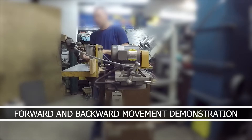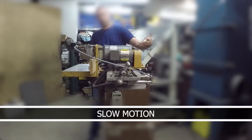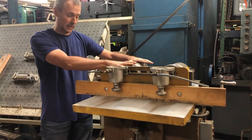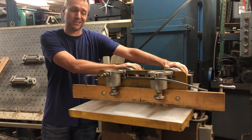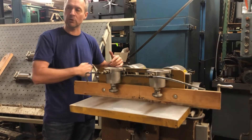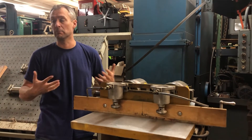One valve drives the whole motor and sled unit forward, and another controls the driving of the sled forward and backward. That's to keep it from going too fast forward. The weight of this sled is enormous — a huge amount of the machine's weight is in the solid metal sled riding on the linear guides, plus the weight of the two motors with the spindle blocks. You don't want that slamming backward or forward, and slamming forward can easily break bits and wood, especially with a smaller diameter bit.